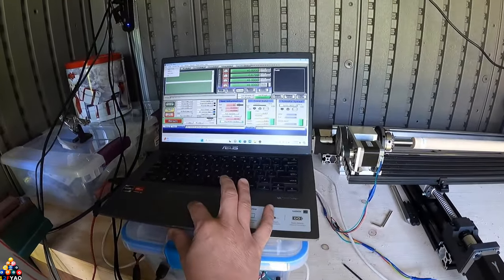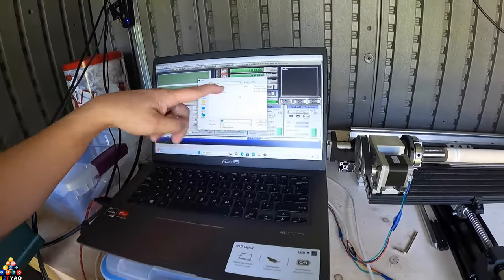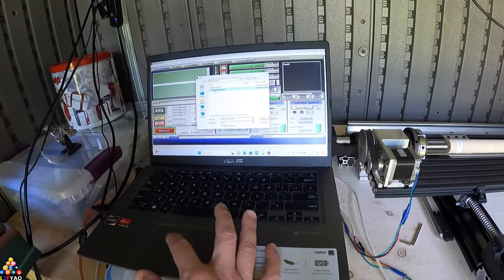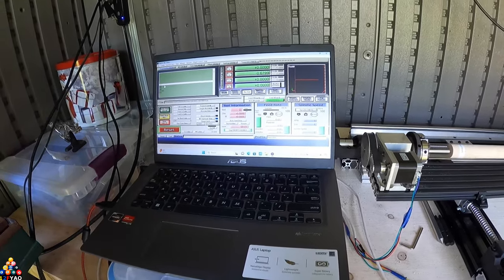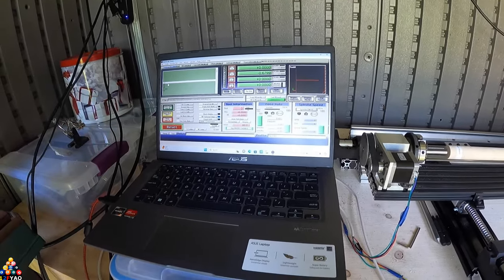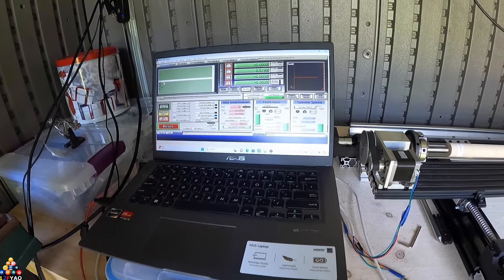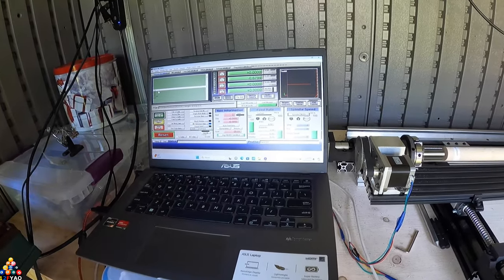Once I set up my program I have it where I load the G-code. I have it named 'shaft taper' because all I'm doing is shafts for now. The small movement is probably the most important to me. This is how I wrote it: G54, G20, feed rate at 10, G90 absolute, G1, Y at positive 0.007 — that's my last value — then return back to start.